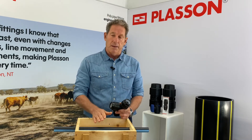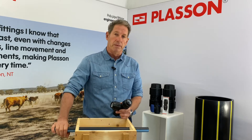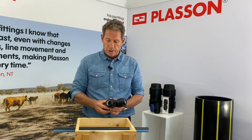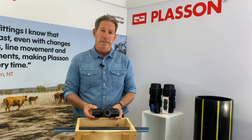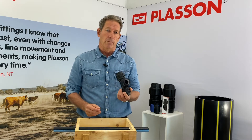Like the coupler, they are really good where the installation might be quite tricky. In this case we've got some 32mm pipe and we want to branch off with 32mm pipe. If we tried to do this with a standard T it would be very difficult, so in this situation the slip repair T is perfect.